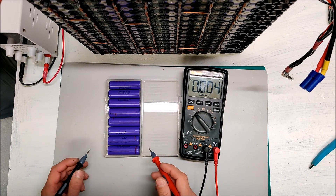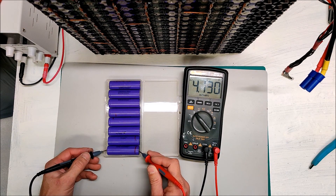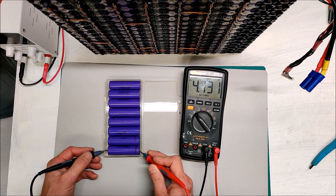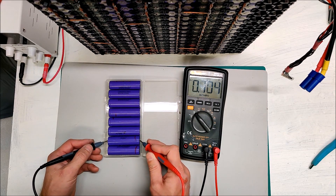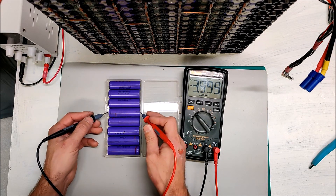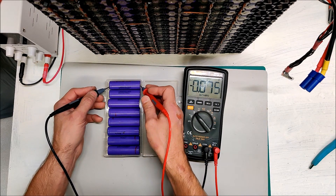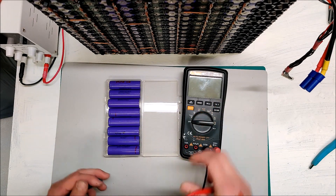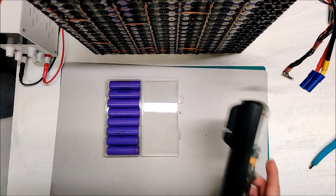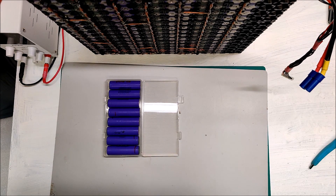I found this box of purple LG cells. These were all put away fully charged — that's just how I store my batteries — and they've been sitting for probably six months if not a year. Reading: 4.13, 4.11, 4.11, 4.11, 4.11, 4.11, 4.12, 4.13. After sitting at least six months, none of these are self-discharging; they're holding their voltage beautifully. These are definitely good cells and will be the replacements.